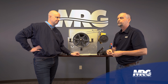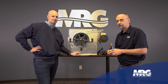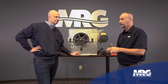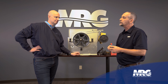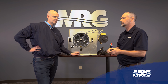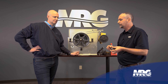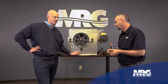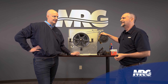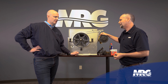If you can take these bolts to a Home Depot, Lowe's, or a local fastener shop, get really high-strength versions of these guys and you'll have a better chance of not breaking them. We'll make other videos about what happens when you do break them, because it's very common, especially when you're in cooling towers — they're completely deteriorated and you're lucky to even get them out, much less use them to push anything off. We've used everything from a torch to other methods — we've been down that road a bunch and gotten much better at it.